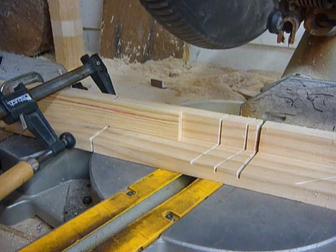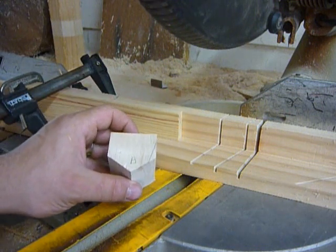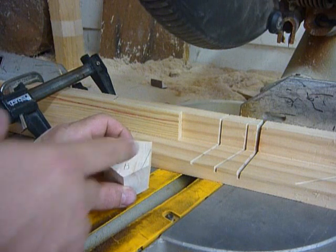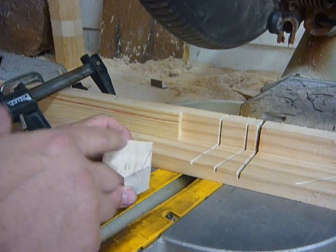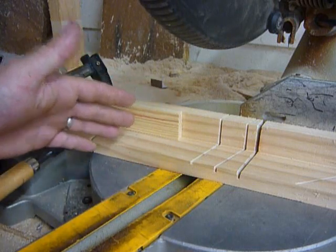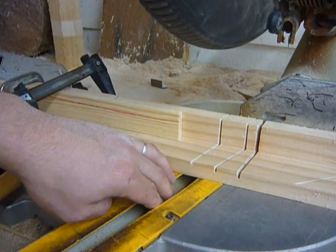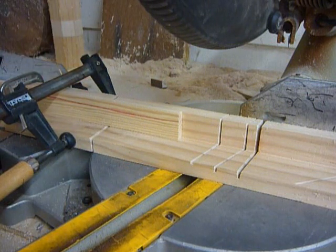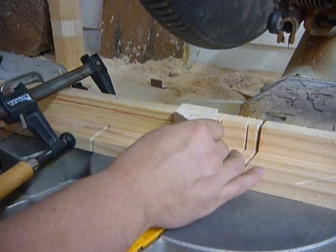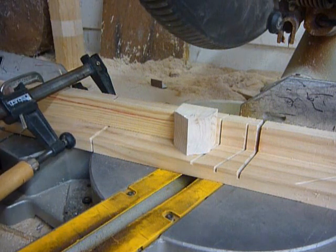Over at the miter box we're ready to make this cut. Even though we have a line here, we can use a little math to get the exact degree. This angle was 72 degrees, so in order to bring it back in line with the star, we need the complement of that angle, which is 18 degrees — and that's what I've got this set to. I've also got a zero clearance bottom and back fence installed, which keeps stuff from falling in and from getting kicked around by the spinning blade. I've also got a stop block clamped in place, set to leave the line so I can go back and sand it flush and make sure every piece fits snugly together.